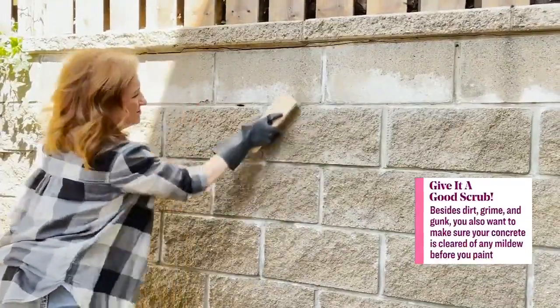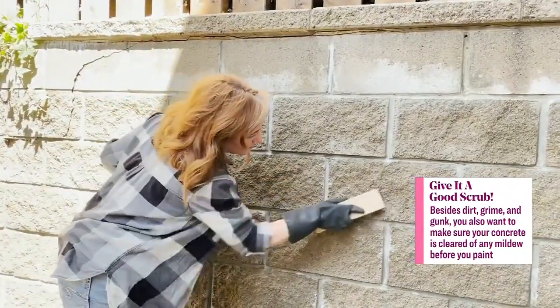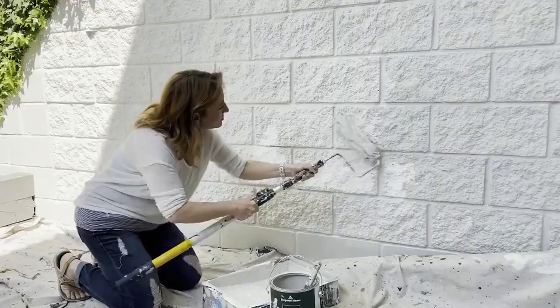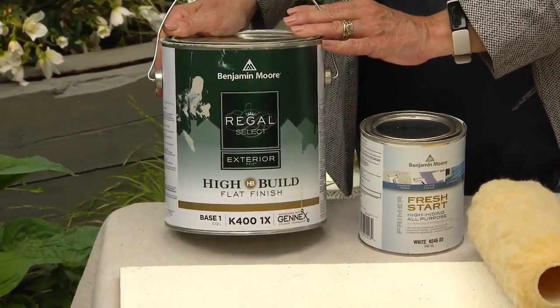I love Revere Pewter — that's a favorite. It is a pretty rough surface, so I imagine there were a few steps involved. Absolutely. It's not like your typical paint project. I started by giving it a really good cleaning using Benjamin Moore's clean product, gave it a scrub, then rinsed it off with clean water. With porous materials like brick and concrete, you have to let it dry for a good two days at least. Then I used a thick block filler primer — nice and thick, dried in about two to three hours. Then I put two coats of Regal Select Exterior High Build on top. It's a nice thick product that's also breathable, so it allows moisture and vapor to come out. I used flat because I just don't want my textured concrete wall to be shiny — you want to think about the sheen for sure.